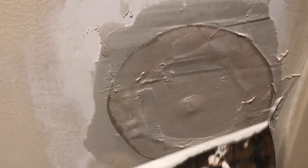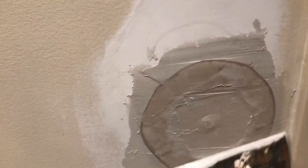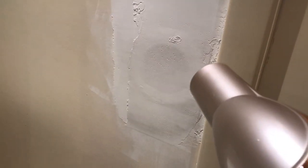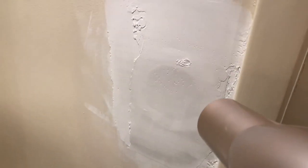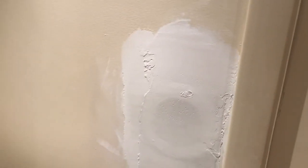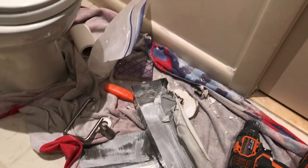Get all the air bubbles out — I'm doing this one-handed while holding the camera, but you get the idea. Get a nice first coat, skim all of it out. Don't worry about being perfect with the first coat — you can see it's a little messy, but you're going to sand it down anyway. To speed this up, grab a hairdryer. As soon as it turns all white, you're ready to sand.